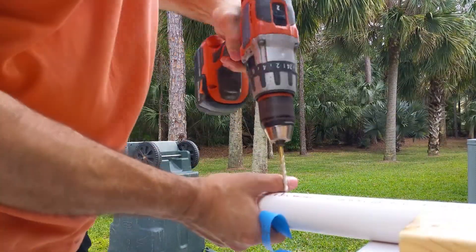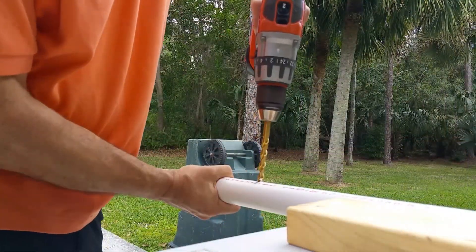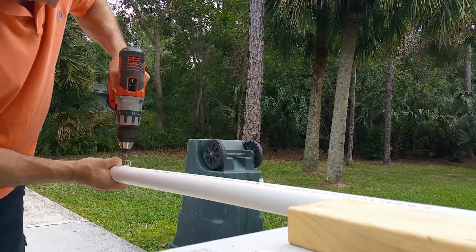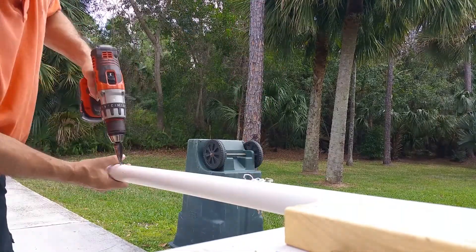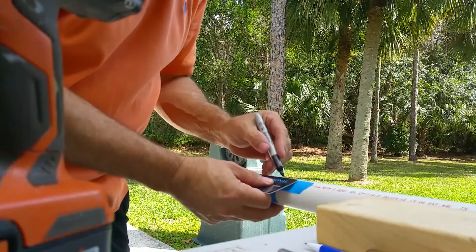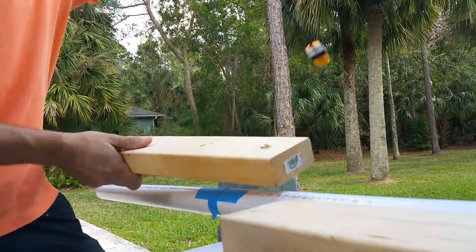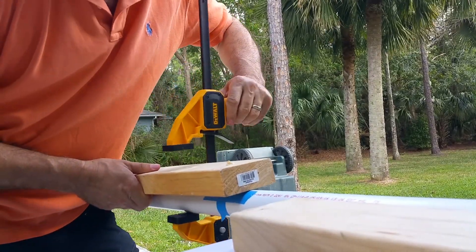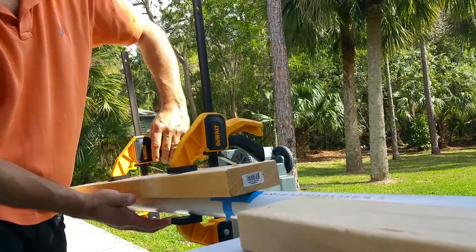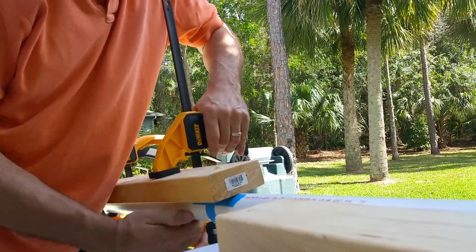Here I'm drilling some of the mounting holes for it. One hole I drill — this hole here — I kind of bugger up. You're going to see me make a drill guide out of a 2x4 a little bit later. The great way to drill, I realize now, is the step drill. I'm marking the hole, I kind of bugger it up, and I'm going to be clamping a 2x4 to the PVC as a drill guide so I can get the hole properly centered.